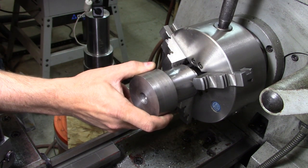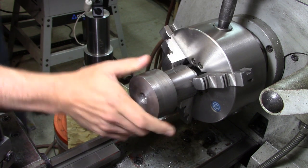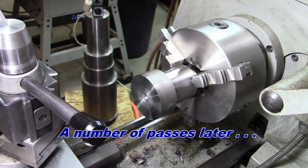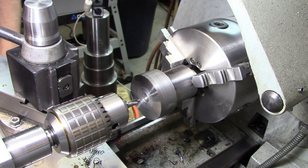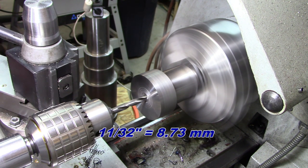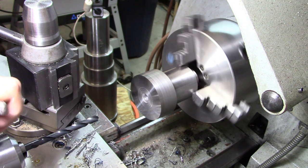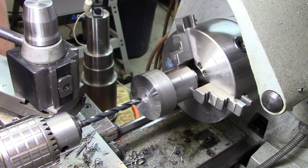I have plenty of extra material on the smaller face — it's only coming up to about there — so I'm going to grip it on this side and then support this back end when doing anything really serious. Now it's time to center drill this and start drilling. Because I want to get this hole started straight, I'm using an 11/32nds short carbide drill bit.